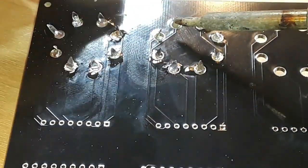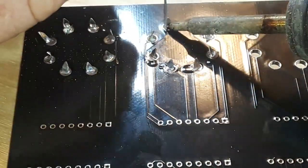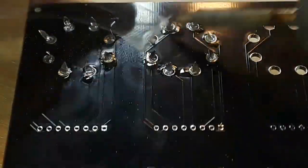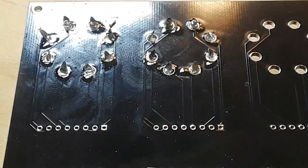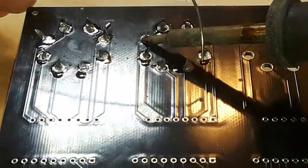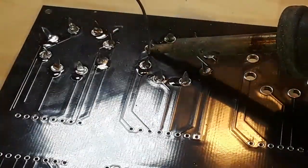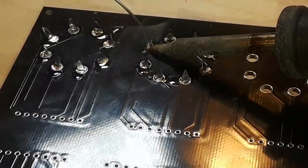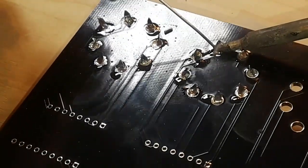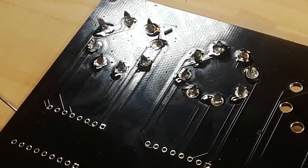Another thing, the vacuum tube rectifiers in tube amps will sag. Not much, maybe a half a volt to a volt or so, when there's a lot of output going on, mainly with the power tubes like the 6L6s. So that sag is said to give tube amps a sweeter sound. If it's sweeter, like I said, I don't know. I don't really have the ears to tell you that.